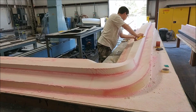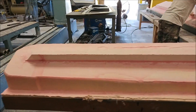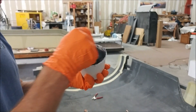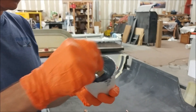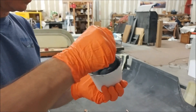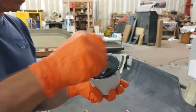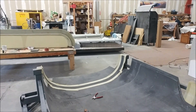The guys are a little further along on the wing spar plugs — they'll still be in the picture for quite a while to come. I got Jeff's expert advice throughout the hysol process since I haven't done this before — I watched Jeff do it but hadn't done it myself. I mixed up the hysol in the right ratio and gave it a good mix for about 10 minutes.